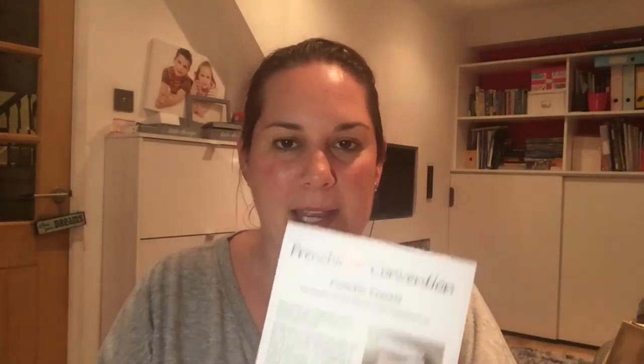I saw some bloggers using this Easy Crackle and was really impressed. You get a crackle effect, which I love — particularly with strong contrasting colors. For example, you paint your base coat a dark dark gray, apply the Easy Crackle, then paint your top coat, and the crackle glaze effect comes through beautifully. The thicker the layer of crackle, the larger the crackle, and the thicker the layer of paint applied on top, the thicker the crackle. You can find Max on the Friendship website giving demos and chatting, along with instructions on how to use the paint.